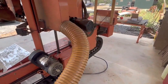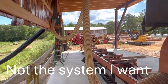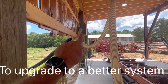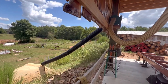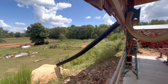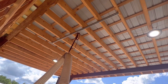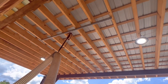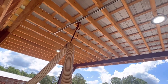I'm going to do a little adjusting to my dust removal system. We've got 25 feet of clear flex hose and a 220 three-horsepower Grizzly blower motor. Off the dust collection system, I have a 10-inch flex pipe in the back cut at an angle that I just temporarily mounted up top. I went to Tractor Supply and got some door track — I believe it's 10-foot door track — and just used a strap. I drilled through the door track into the rafters up top and put it in with some torque screws. It seems to do pretty good.